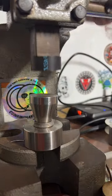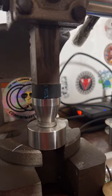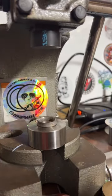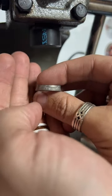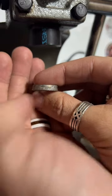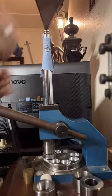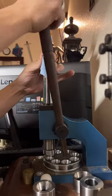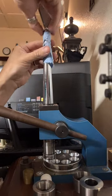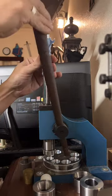Almost all of my orders are made on TikTok Live — I got this order yesterday and here we are working on it. Now we've got that stretched out and it's so much more even. Usually you'll develop kind of a dip around the date if you go right to the ring stretcher. Now we're going to do some light stretching — this one's going to be an eight and a half, so we're going to stretch it to at least a nine and a half.